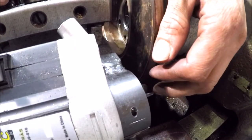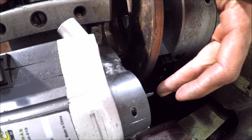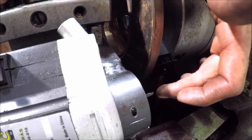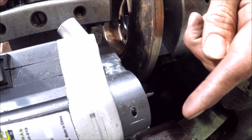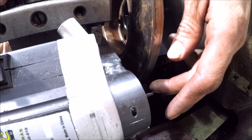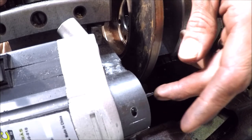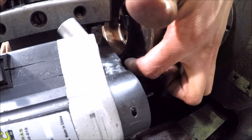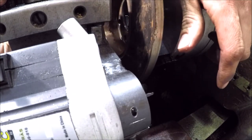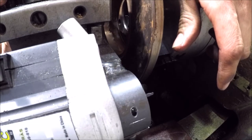I'm hoping you can see this — it's not perfect but I really don't have any other way to mount my camera. There's the tip of the mill. The reason this is on the back of the lathe is that I want these two discs to be symmetrical but not the same, since they're on different sides of the vehicle. I want the slots on one disc to go backwards compared to the other. Let's hit it.